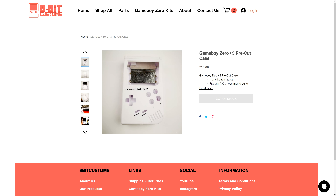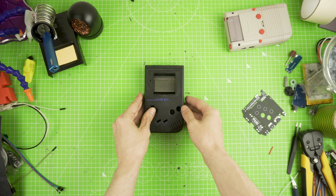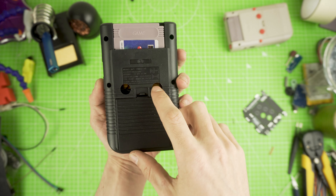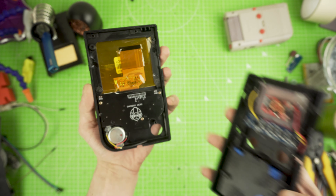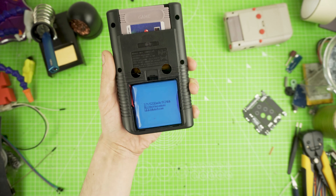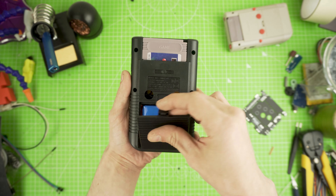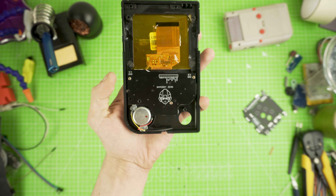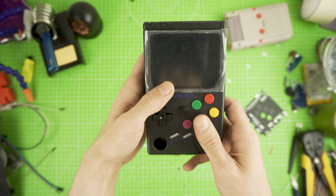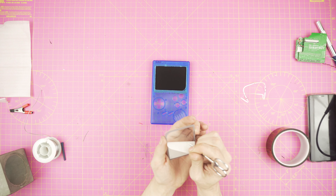These tend to go quickly as I'm not making a lot of them. So for this video, we will use the power of editing to modify the case — and it's already done. From buttons, joystick, left and right trigger button holes, everything is done. The cartridge is modified and fixed in place so we can use most of the space inside the case. Battery bay is also modified and the battery added — a 5000mAh Bluetech one. On the inside, I already added a 3D printed bracket, display, and speaker. The micro-USB cutout and screen lens are also added. If that's too much info too quickly, you can go to the linked video where I go more into these mods.